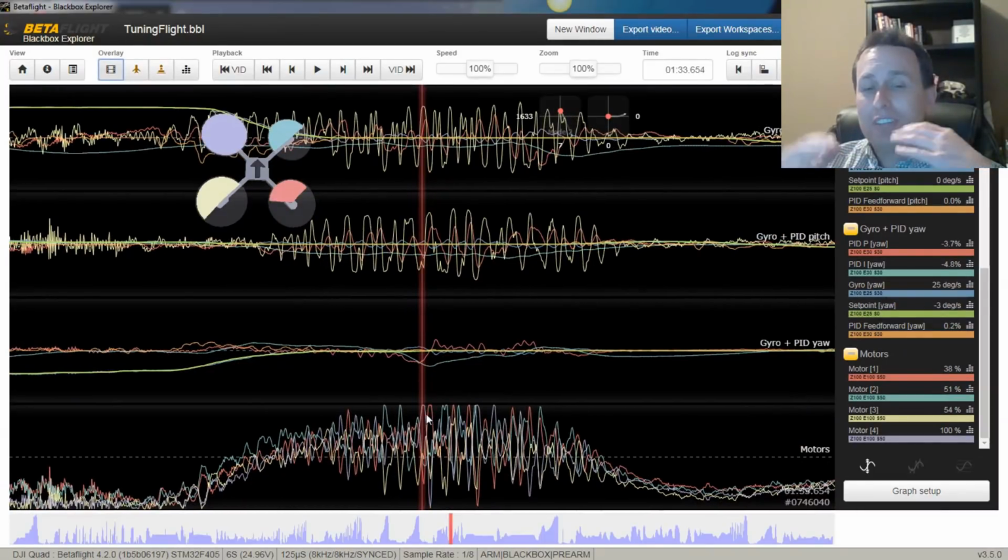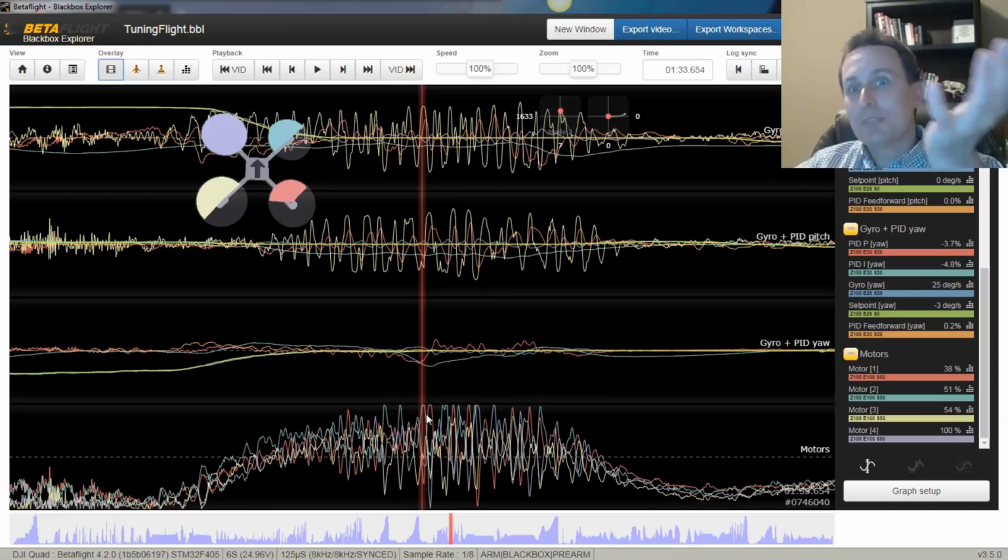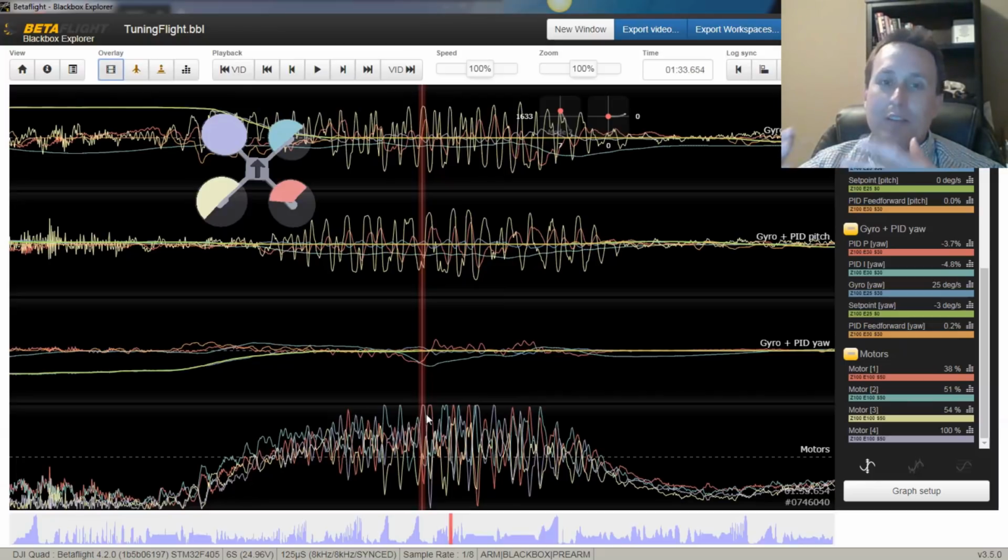That is showing you're just about at the peak of where your D gains can really be. Any higher than that, it's just going to saturate the motors even more. You're not going to get anywhere. You'll just keep pushing up the gains, which has negative ramifications with noise and other smooth sections of flight, but you're not going to get better prop wash handling.